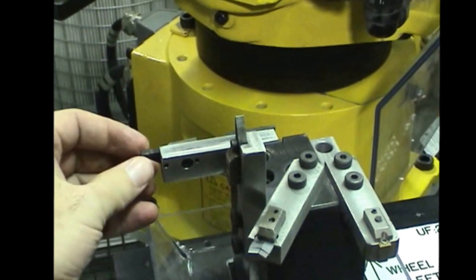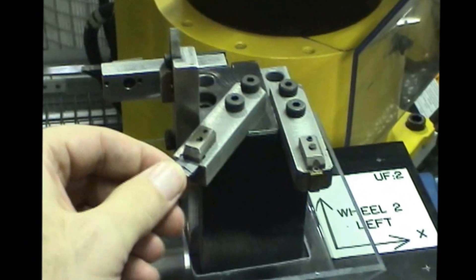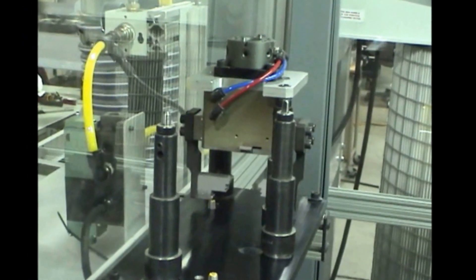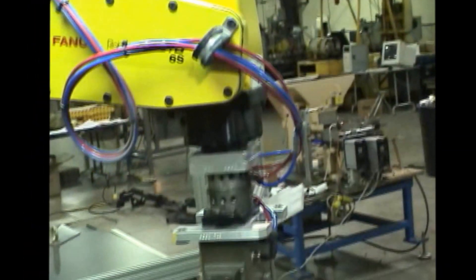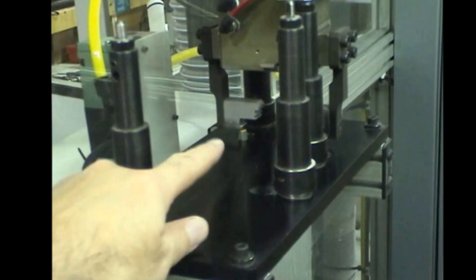Now for a quick show of our skiving operation — you can see all these tools. We only have one of these in use. These are essentially lathe bits attached to this detail. This one has rubber compliance on it — it floats in this axis. The rest are rigid and mounted. We have these replaceable tool bits here, here, and here. We also have the docking station for the two tools — it's polarized, so only one gripper can go into one position specifically. We have the air plumbing bound on top of the robot, coming out of the EE connector out of the back of the robot, going right up to the valve pack. There are no inputs on this tool, mostly because of concerns about fatigue. Instead, we sense what tool is present in the fixture to know which one should be on the end of the robot at that time.